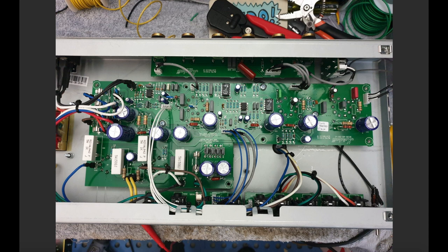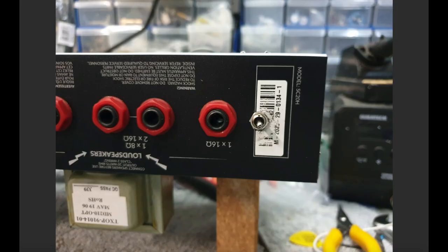The black wire, which is a ground wire, comes up here. I've used the ground point of the second cathode resistor. You could probably choose other ground points, but that was pretty convenient, and I was pretty confident that by using that point in the amp, I wouldn't be introducing any risk of ground hum and so on. It's fine, so take your ground from there. The shielded coax, you can see underneath the board, comes up here and connects underneath this PCB as you saw before. And finally, here's the rear of the amp.